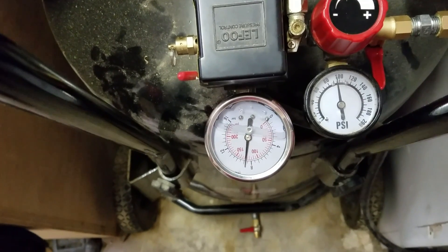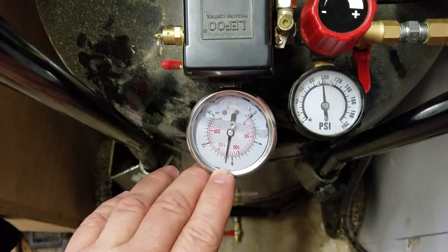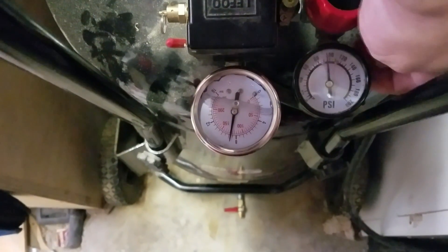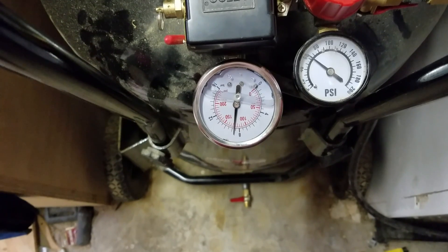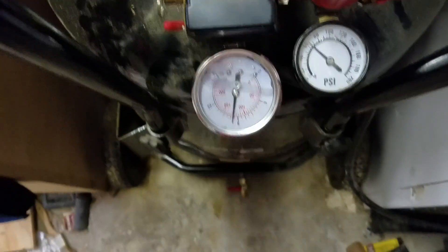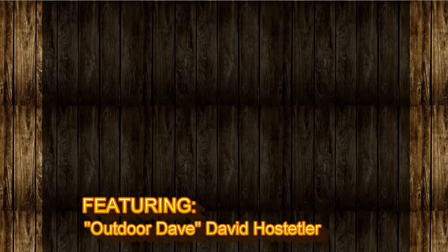Today is Wednesday, April 20th, 2016. We're 24 hours into this fix, and you can see we're at about 122 PSI. So it looks like I've lost 18 PSI in 24 hours — I can honestly live with that. Flip the lever, the system compresses, power airs up. No hissing or anything like that, so it looks like we're good. Time to flip that back off, open up the dump valve, and call it good. That, ladies and gentlemen, is how you fix a compressed air system. We'll see you next time. Bye.